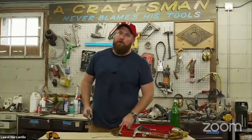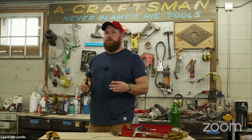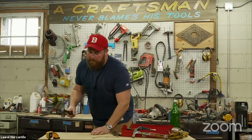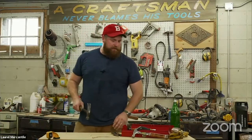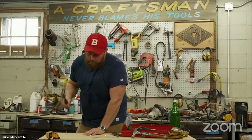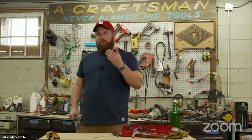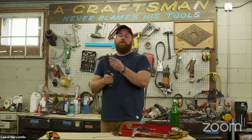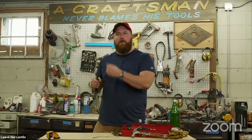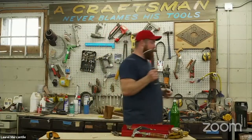Now, if you're wanting to break something, you're gonna hit it as hard as you can. Okay, if you're wanting to hammer a nail in, there is some finesse to it, okay? You want to make good straight hits, okay? Now this is not a good board that I'm nailing into, this is a piece of MDF, but as you come down with it, if you hit it good and straight, it'll drive it good and straight. But also, if you let the head of the hammer get rounded off, then it'll try to bend the nail as it hits. Okay, you have to be a little more accurate then. All right, I drove that one a little far. I was gonna show you how to use the claw side of it.